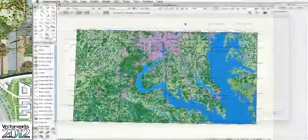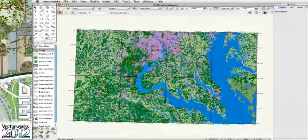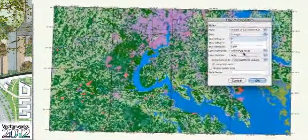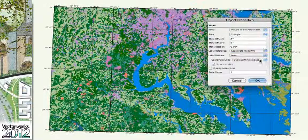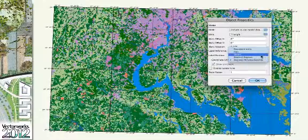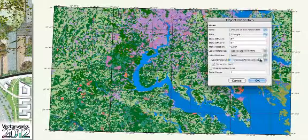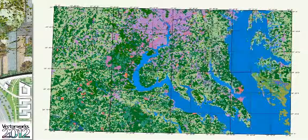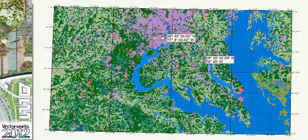the same document. This is apparent in the stake object improvements, which allow the stake objects to show both the X and Y coordinates as northing and easting, and to use latitude and longitude in degrees, minutes, and seconds directly on the stake object label. Alternatively, you can also use the traditional methods rather than degrees, minutes, and seconds for each stake object. This is selectable individually by stake object, so you can choose to use the new georeferencing features or not.